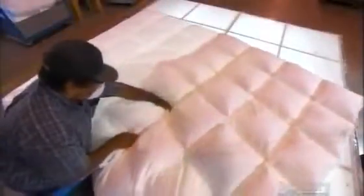Emptying one tube at a time, they fill one box at a time. That down portion stays within the box's fabric walls. Of course, that air pressure piles it all at one end of the box, but they'll spread it out later. They close the open end of each row temporarily with a plastic clip. Once they've filled all the rows, the duvet goes off to the sewing department.